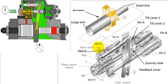When the pump starts and creates flow and pressure, servo hydraulic pressure is applied to spool A, thereby pushing the spool to the right. The groove in the spool pushes the pin of the tilt lever, thereby moving the tilt lever in an anti-clockwise direction. This tilt lever pivots around the top pin A and pulls pin B of the feedback lever to the right.